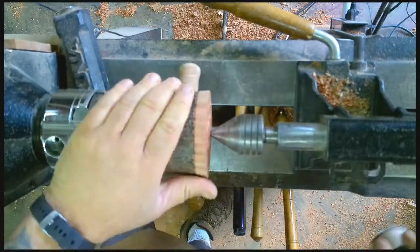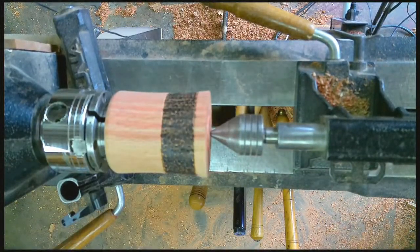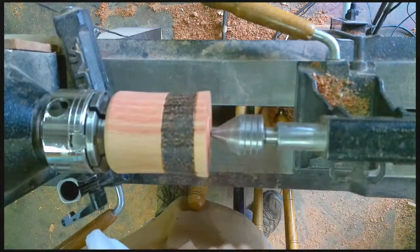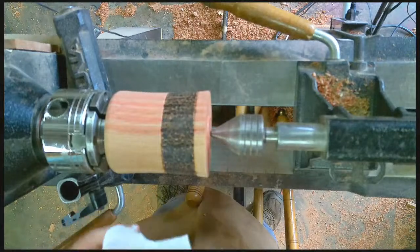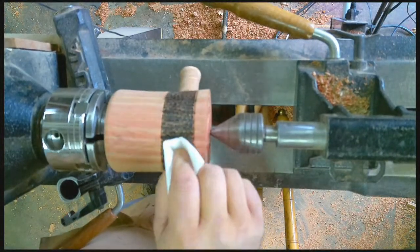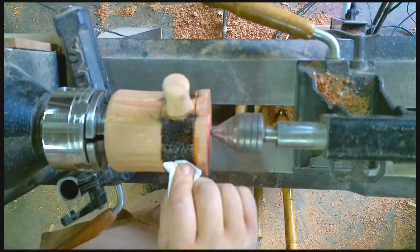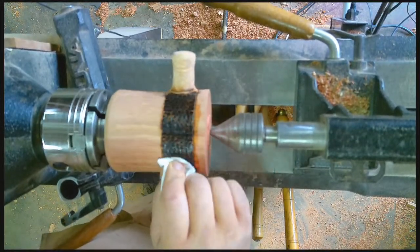All right, now we're going to seal this band with some shellac. That has cooled off enough. I don't need to worry about that. And we're going to go with a 2-pound cut. Yeah, the torch definitely got a lot more dark. So this is a 2-pound cut of de-waxed shellac from Old World Shellac and Everclear. So technically, this is food safe. Although, why you would want to drink shellac is beyond me. But you could.